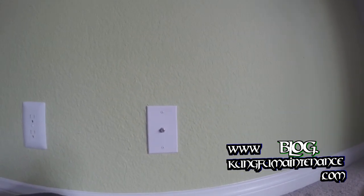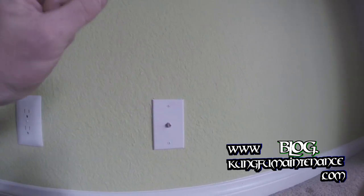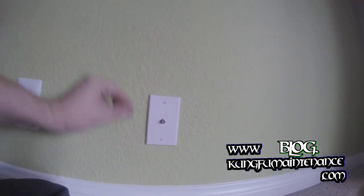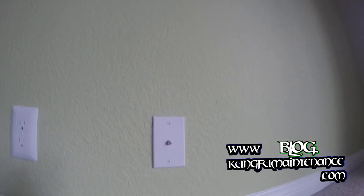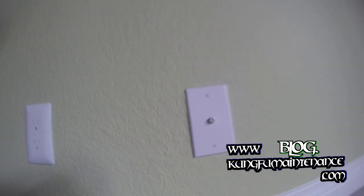This one's not too bad from a distance — up close you can see it, but from a distance it's not going to show up too bad. But if it did, you caulk it in, paint it, and then slice through — pre-slice it through and you're good to go. That can prevent someone from damaging the texture.